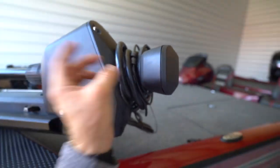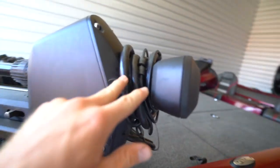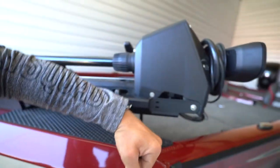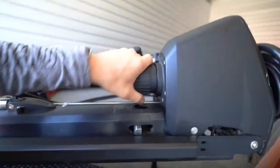We'll go more in depth in a further episode, but Devin and I were trying to raise up the shaft because the coils are getting a little tight and I think that's why it's messing up the spot lock — it feels like it can't twist and keep us in position. The steps online say to lift the trolling motor halfway between stowed and deployed, then loosen the collar and you can raise it up. We were in here for 20 minutes breaking a sweat trying to fix this thing.